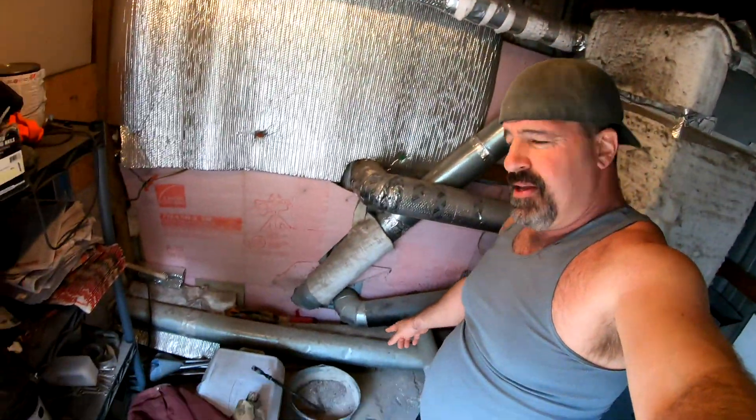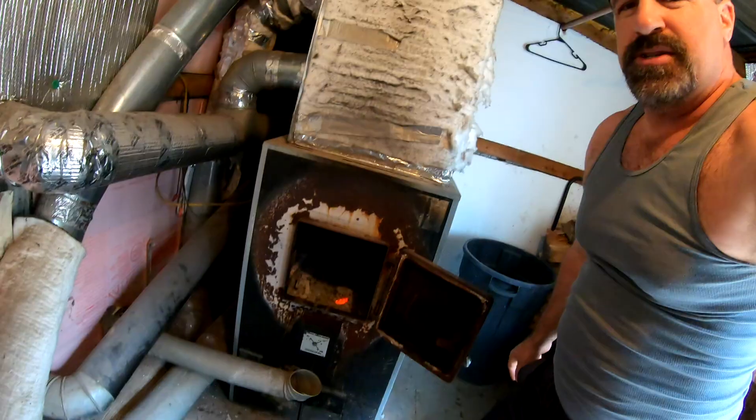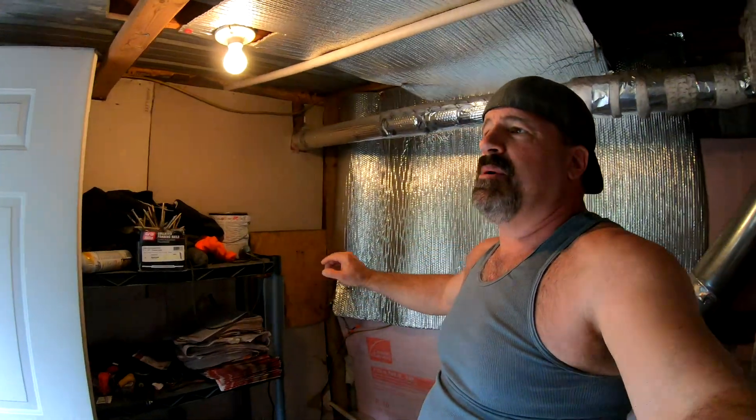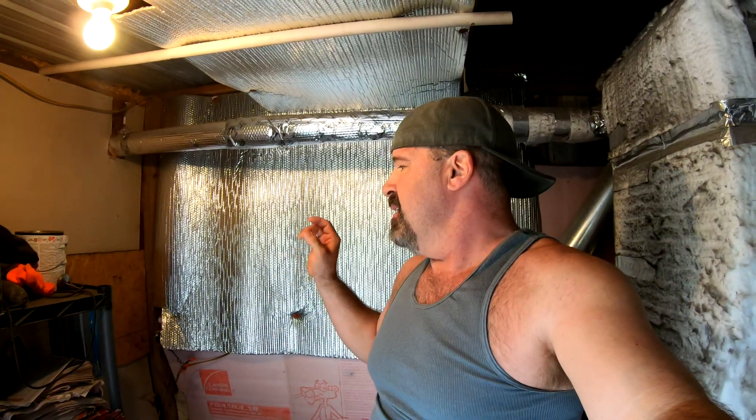Inside the wood burner building there are ashes, wood chips, dust, and smoke from when the wood burner's open — even when nothing's going in it, smoke will poof out. That combined with this being an 8x10 building holds the heat in. This thing pumps hot air into the house, but at the level that the grid tie sits, it will get up to about 110 degrees when fully cranked up. Heat is the number one thing that was destroying it. The fans also end up failing because of heat or because they get so much dust, ashes, and smoke residue built up inside them — it's just a bad situation to put it here.